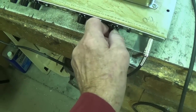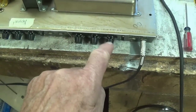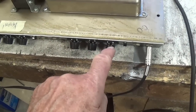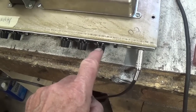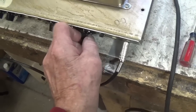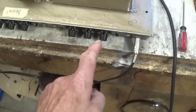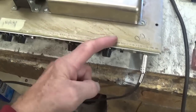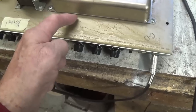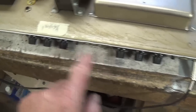Okay, we'll crank up the volume. There's still a tiny bit of scratchiness in the volume control. It was terrible when I first tested the amp. I've cleaned it twice. And I'm going to give you a little tip. If after a thorough cleaning, your volume control still is scratchy when you wiggle it back and forth, check the coupling capacitor that is shielding the volume control from the DC plate voltage of the tube that is immediately prior to the volume control in the circuit. Of course, that goes for both channels.